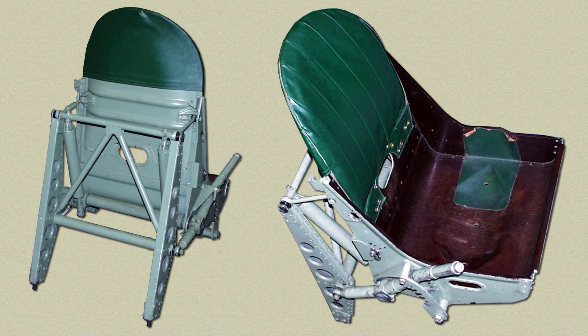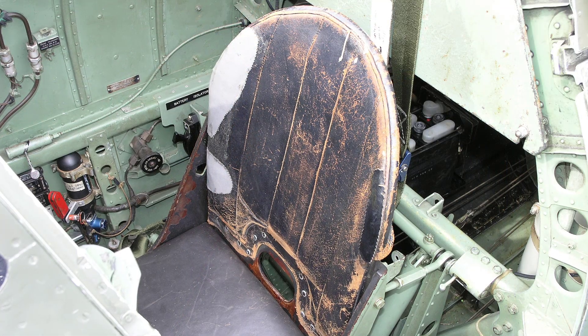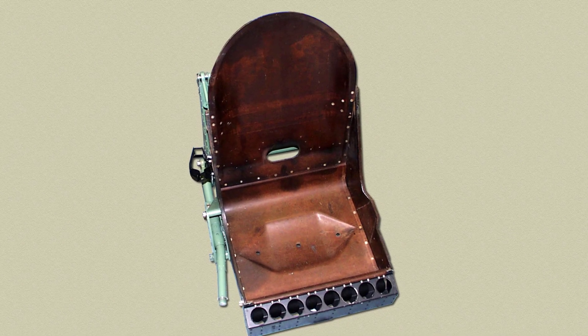The 1942 manual now moves on to the pilot seat and mounting. It consists of two vertical channel section members braced by two cross tubes and two tubular struts forming an inverted V between the cross tubes. The mounting is attached to the fuselage by two spigots at the bottom of the channel members engaging in sockets at the bottom of frame 11, and two spring-loaded plungers on the cross bracing members at frame 11 that engage in the tops of the channel members as shown here. With this form of attachment the mounting, complete with seat and operating gear, can quickly be detached from the Spitfire to assist with maintenance. The seat itself is of moulded Bakelite, which was an early form of plastic, and contains a well for the pilot seat-type parachute.